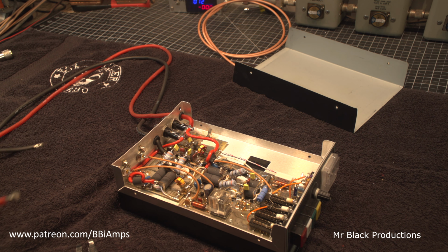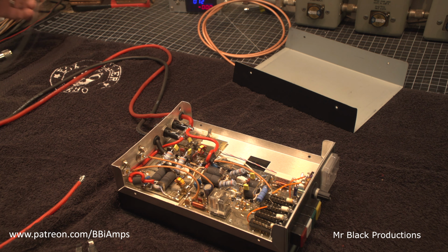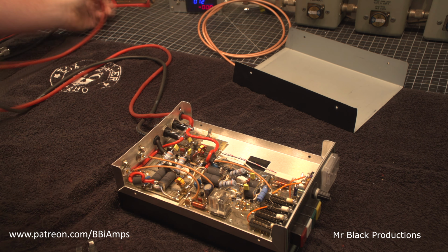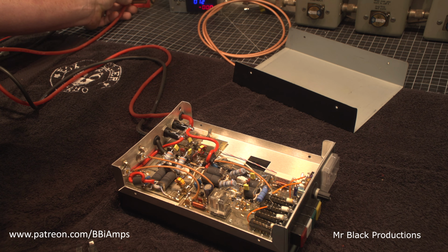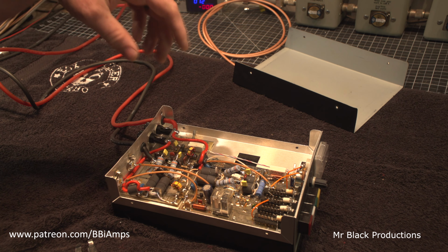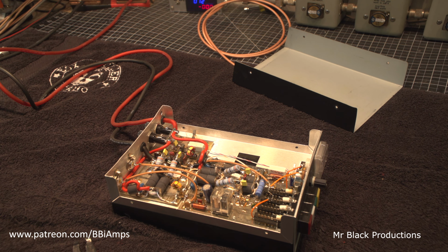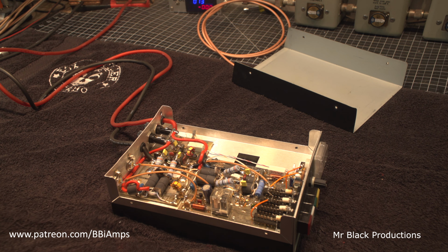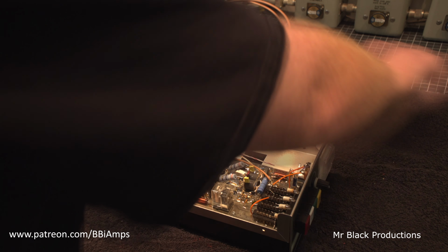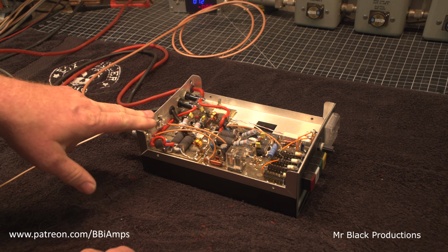The other thing that can cause that cap to radically depart the cabinet in the violent fashion that it has is bad capacitance on our positive lead, and a little bit of AC voltage filtered back into the positive circuit. There's a glass capacitor that's right here. If that cap or this cap is removed, and let's say this ferrite is removed and this ferrite's removed, and it gets put in a really awkward position frequency-wise, it can let some RF leak back to the positive lead, and in turn it'll wipe out that electrolytic and send it smoking on to Jesus. But I don't think that's the case, because our ferrites are here and the diodes are still in one piece.